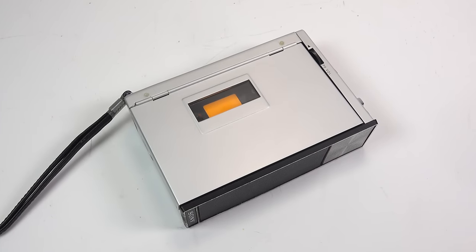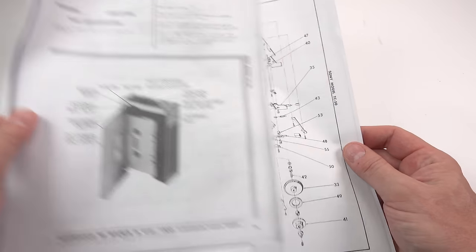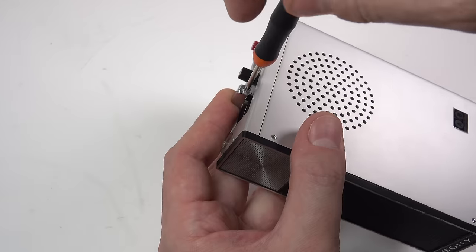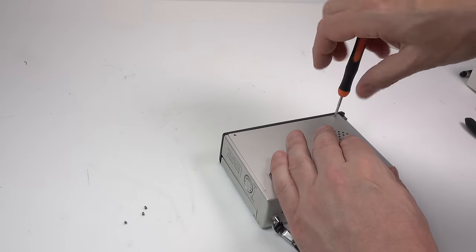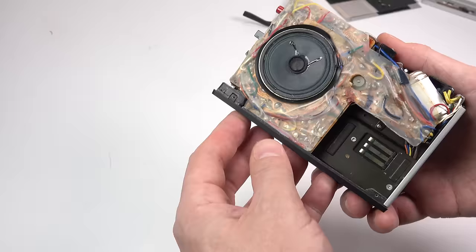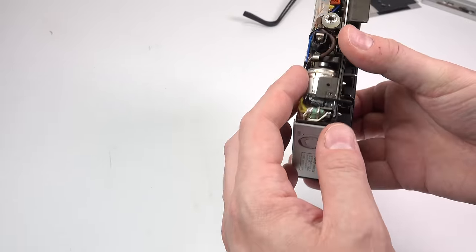Given that this is approximately 50 years old, it should come as no surprise that it isn't working — this is something I knew when I bought it. I really just got it to show as a non-functional historic object, but I decided to try and see if I could get it to play a tape as well. So I downloaded the service manual to see how it came apart and bought it a new belt. The disassembly instructions were incredibly brief, just listing the screws that needed to be removed — a total of two from the control panel, one from the lever, and four from the cover. Once that cover was removed, I really did expect to be able to see the belt, but it turns out there was still quite some way to go. This thing is packed in like a sandwich of tightly crammed together components — it looks like every millimetre of internal space has been put to some use.